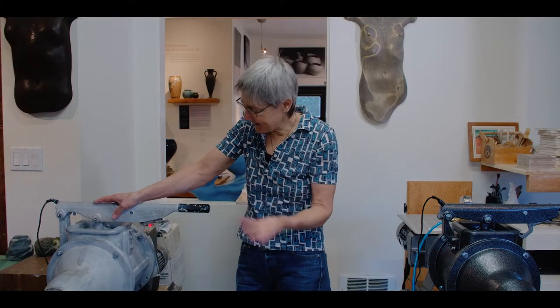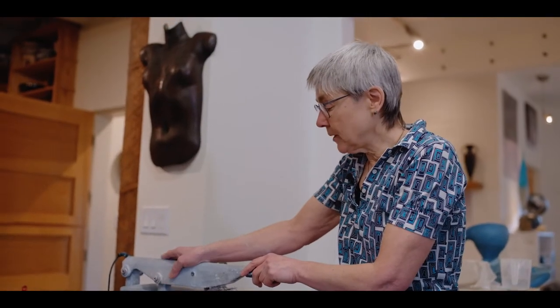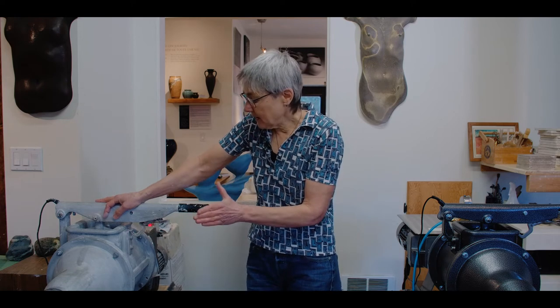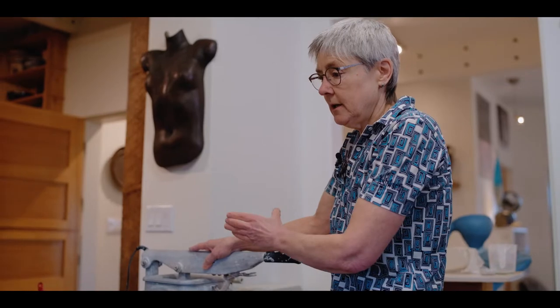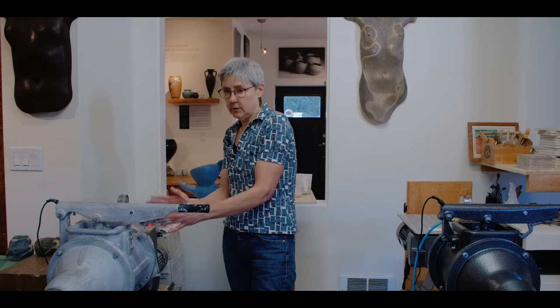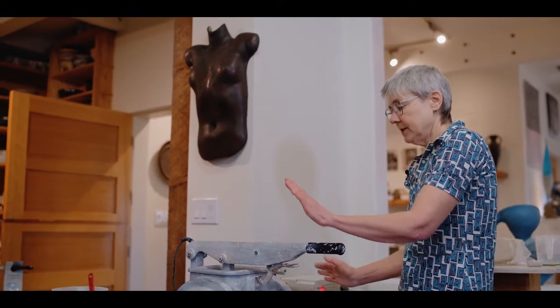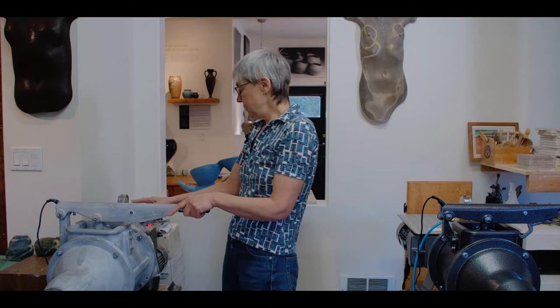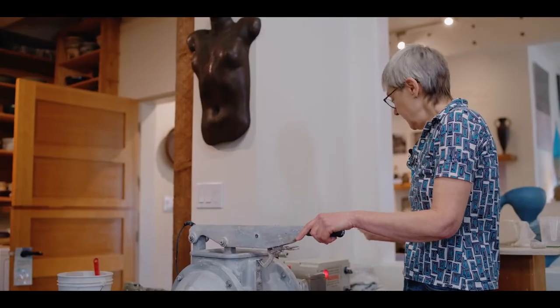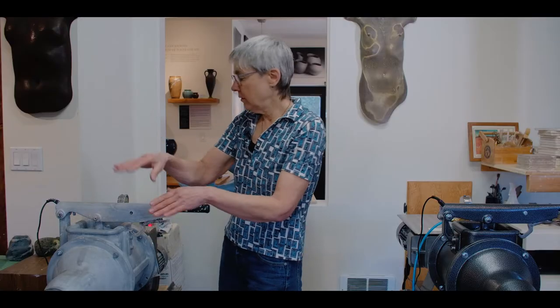The clay's been mixing for about five to ten minutes. I did add a little bit of water — it looked a little dry, but I think it's just right. I've already vacuumed it. When I switch the machine over to pug, as it initially starts to shoot the clay out the nozzle, sometimes a little bit of air will kick back in. You'll see the dial will bounce a bit. So I switch it to pug, stand here, and as soon as I see that bop up, I hit stop, let the vacuum bring the dial right back, and then press start again. From there it'll pug through the whole way.